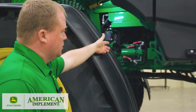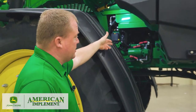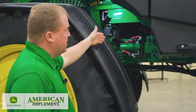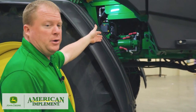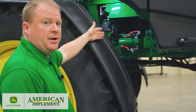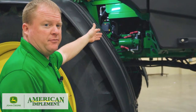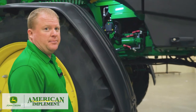And then to the lower right of that — everybody's asked, what is this? Is this a new pump? This is an auxiliary safety pump. If something were to happen to the hydraulic system on the machine, this electronically driven pump would engage to make sure you have steering and brakes, so you can safely pull over to the side and stop. A great safety feature added by John Deere.